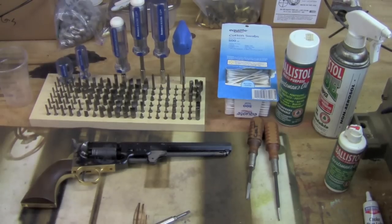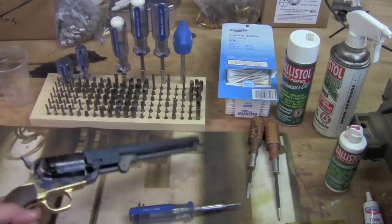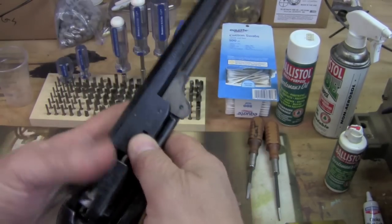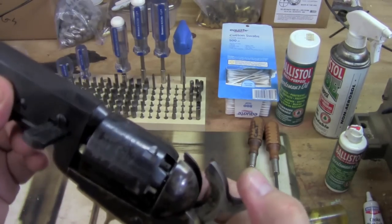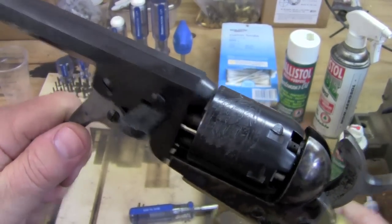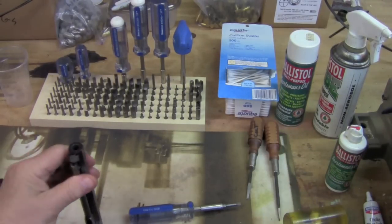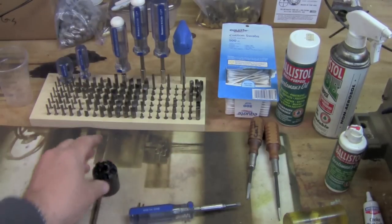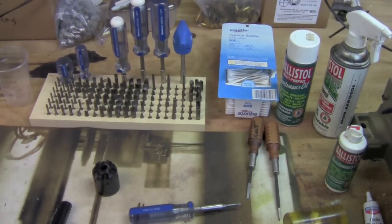The other tool you may need is a plastic mallet, because Colts are held together by a wedge that goes through the arbor. On a lot of them you can thumb-press it out, but this one needs a tap — and there it goes. Now if a barrel doesn't want to come off and it's tight, put the gun on half cock, drop the loading lever, it'll come down between two chambers and cam the barrel group right off. So Colts break down into three main sub-assemblies: the barrel group with the loading lever on it, the cylinder with all the nipples, and the most complex group — the frame, where all the action parts are.